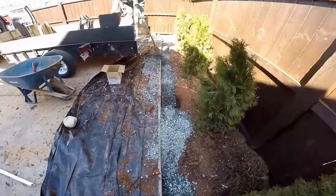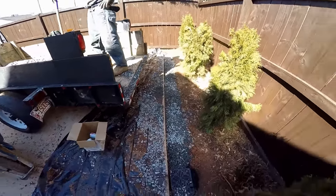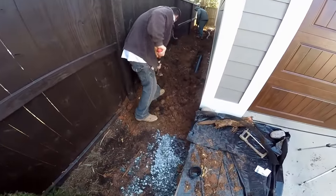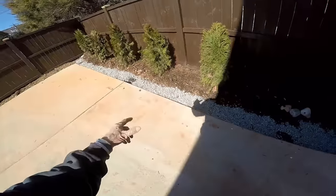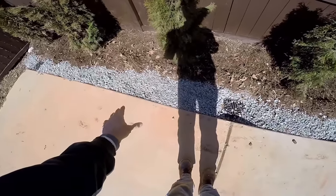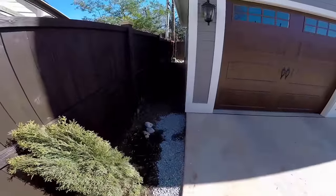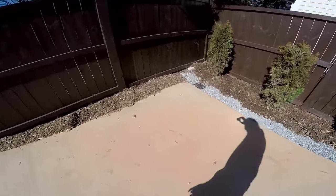You can see we're just finishing bringing our gravel up to grade. Right now it looks a little messy but once we clean it all up it'll be really nice — bring that gravel right up to the bottom of that concrete. We have PVC perforated pipe with holes pointing down. The guys are covering the solid pipe which leads to the sump pit; the sump pump picks it up and carries it away. Basically this is a giant channel drain — water runs down the driveway, drops through the voids of the gravel, down to the bottom of the trench, floods up into the holes of the perforated pipe, and the pipe carries it away. We put in an M98 half-horsepower pump — about 80 gallons a minute.